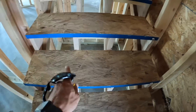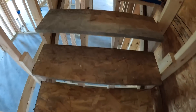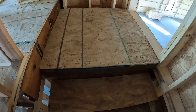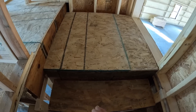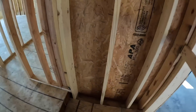I always use four stringers on stairs. I put the two in the middle a little bit closer together because that's where most of the pressure is. These are temporary treads. We've got a little landing up here. Somebody asked why I didn't just buy pre-built stairs — well, this was diverted from the plans and it was a unique space, so we had to build our own. There's going to be a door here so the owners could bring stuff into the upstairs.